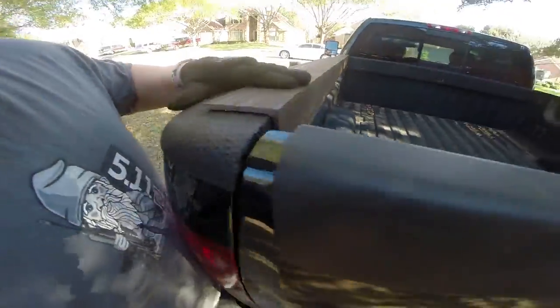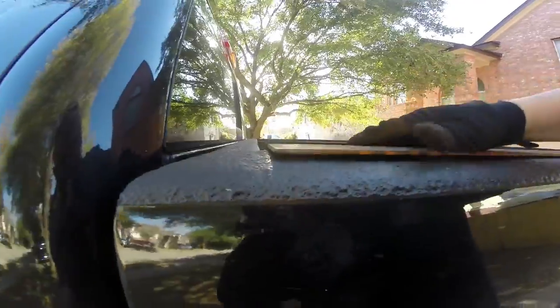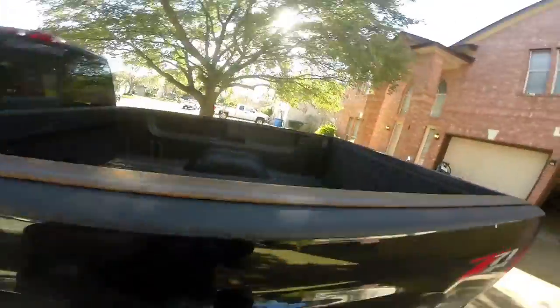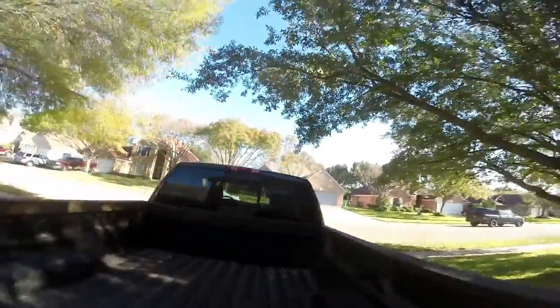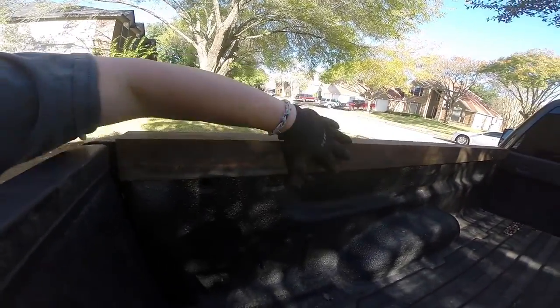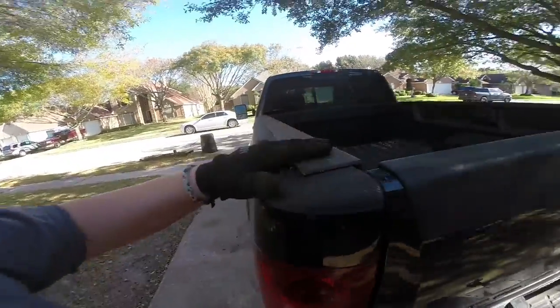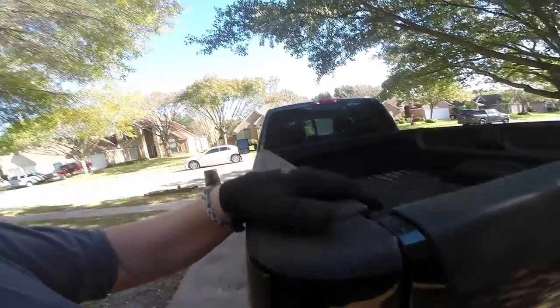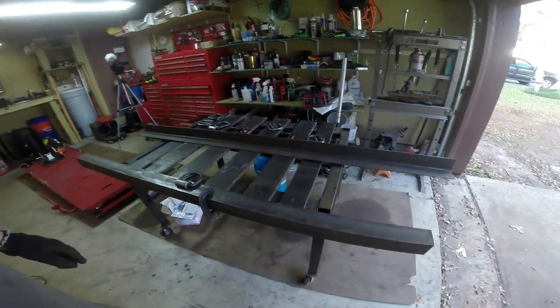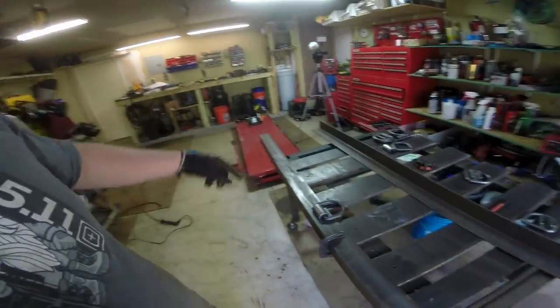Here's basically what you're looking at — you can see it's totally flush. We're going to put in stakes that pull down right there. On the inside of the bed, you can see there's a lip right here. We'll drill through that lip and bolt this in, and our shackles will be welded on the inside. This gives the top of the bed a little more protection, but it won't destroy the paint because I had all of this Rhino Liner on there. Now that we've got this all ground down, we can add the D-rings. I'm going to put a D-ring right here in the middle and one six inches off of each end.